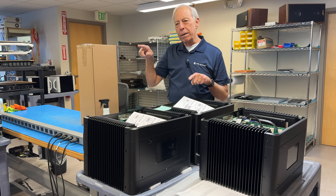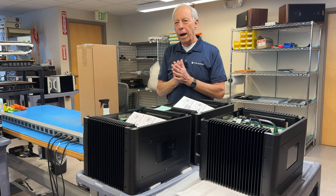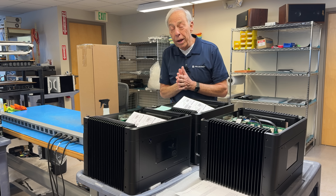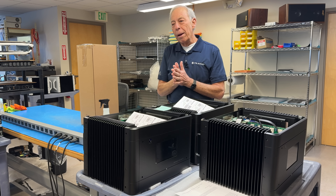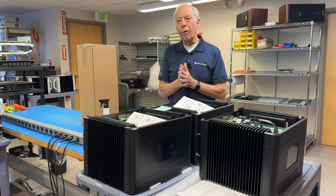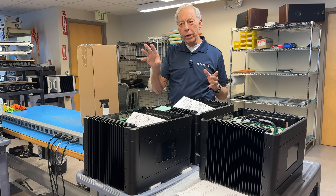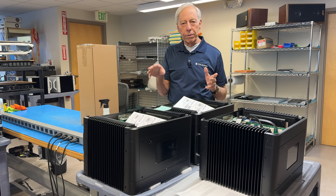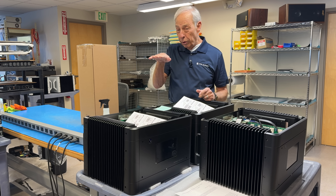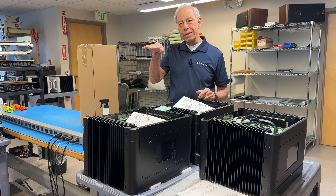What's that mean? Well, if we take notoriously low damping factor amplifiers — like vacuum tube amplifiers — they are notorious for having terrible damping factors. That's because they use an output transformer and they're not able to deliver a whole bunch of current when required. So they've got really low damping factor numbers, because their impedance is high.